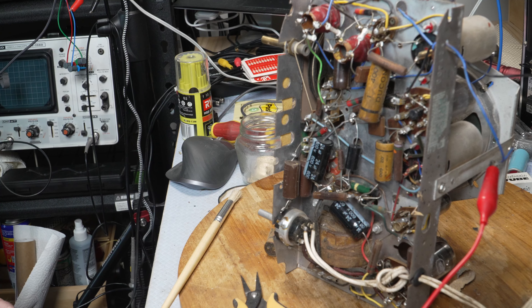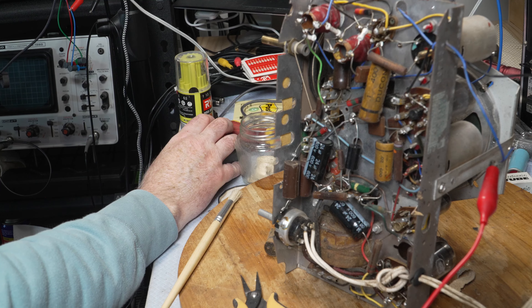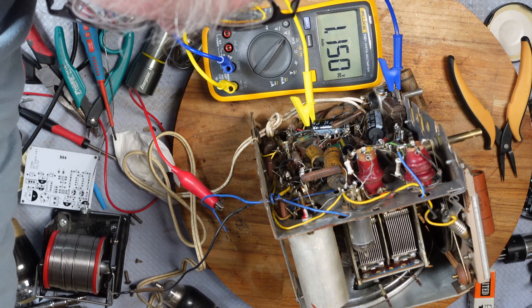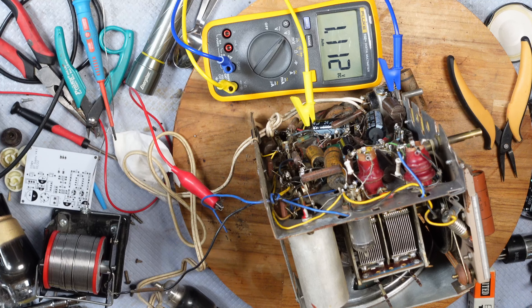Let me just pause — you're probably looking at the back of my head as usual. I'll put some clip leads on it and we'll see what the voltages are doing. We've got some residual voltage in the system, it's going to take ages to discharge. Let's turn it on and bring it up slowly — that's 80 volts. Hopefully the rectifier will start conducting. It's stopped now, going back up — here it comes.